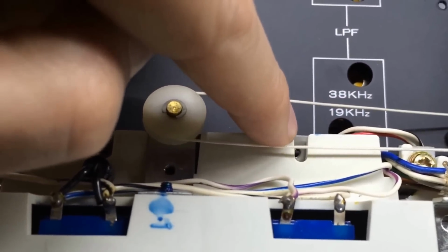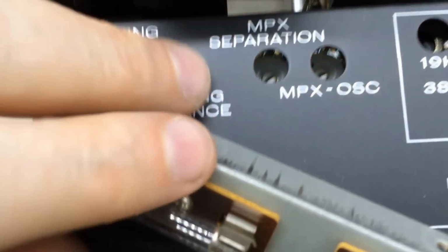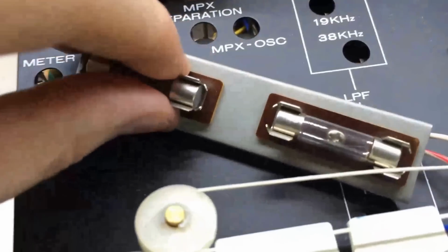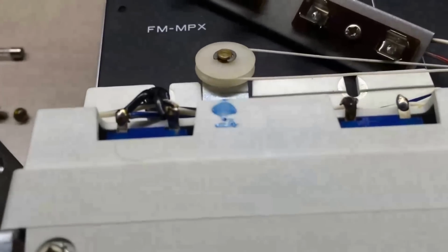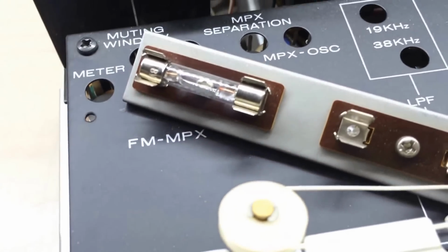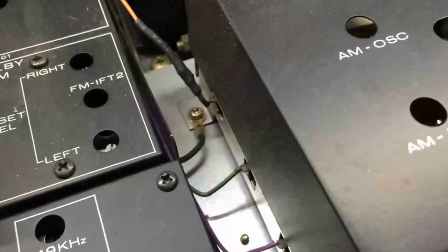Okay, now coming over here to the meter unit. If you'll notice, there's 2 screws, and I've already taken them out. There's one right here. Get the focus clear. One right here. I've already taken both those screws out, laying them right down here. And what happens is this bottom piece kind of pulls out, and you can then get to the bulbs. Similar thing. They pull out just like a fuse on both sides. End up getting two new ones out of the bag here. And you snap them back in, just like so. And put those back underneath.